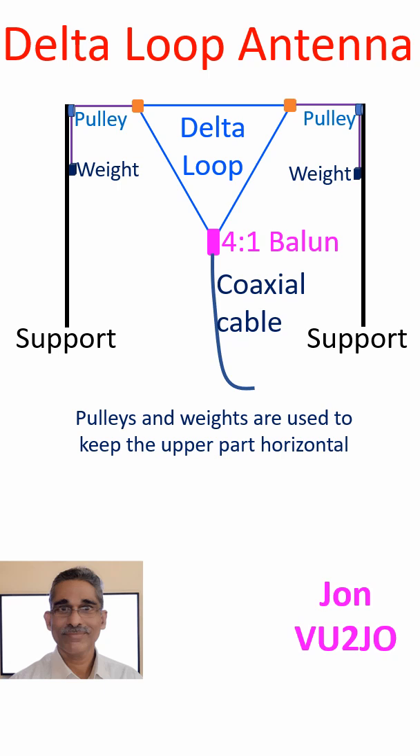On 14 MHz, the antenna impedance is high and SWR will be high. For the center of the 7 MHz amateur radio band with a frequency of 7.1 MHz, the length of the delta loop will be 43.14 meters.